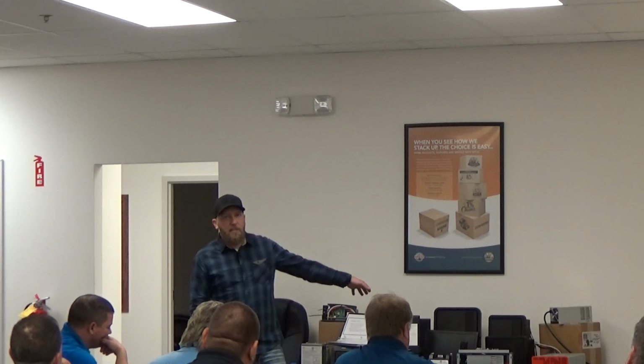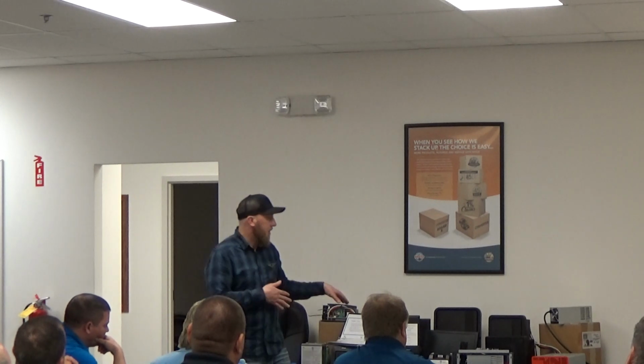There's not a whole lot of problems and solutions with transfer switches. The only other thing I've ever run into with the transfer switch is a call I got from one of the OEMs. They said their transfer switch was not passing through shore power. I went there, and we plugged the coach in, because the transfer switch is the very first connection point to all of the electronics in the coach. Your shore power cord goes there, your generator goes there, that's the main hub before it goes to your panel. So all the power's going through your transfer switch, so that's the first spot you would want to check.